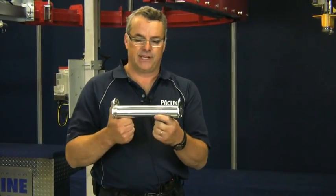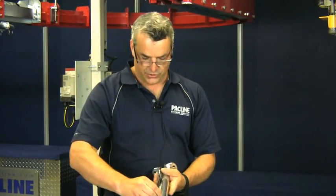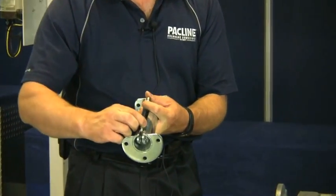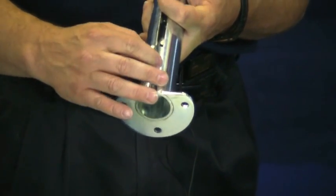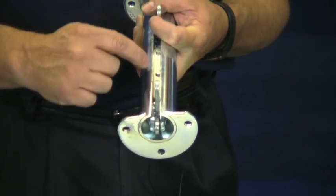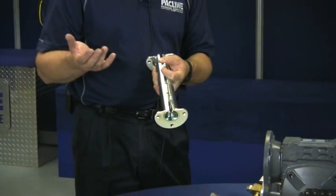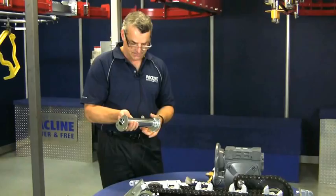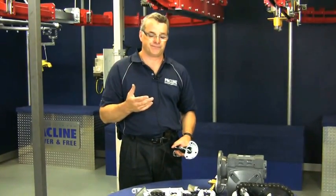So if this chain isn't tensioned properly, it really has nowhere to go. It is stuck in this round track. So what happens? The chain turns sideways — it's trying to shorten its pitch, but it's got nowhere to go. So it turns the chain pendants sideways and they slide on the side of the track. Quite often they'll wear a piece of track. We'll find that the track slot between the drive unit and the take-up, where all the slack chain bunches up, causes the slot in that area to get wider and wider. You can quite often see some evidence, for example, some shavings of metal filings on the floor. Quite often there will be chain surging. Another manifestation is that the drive unit actually jams.